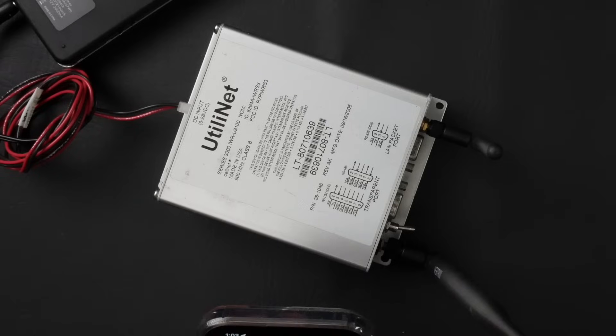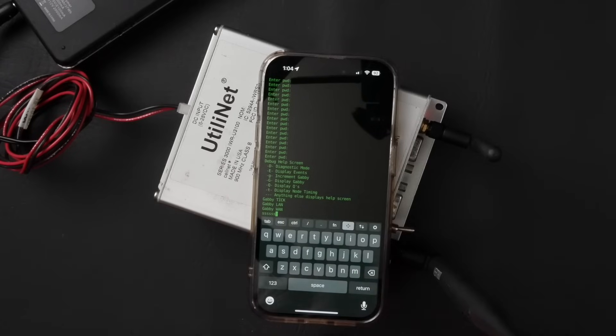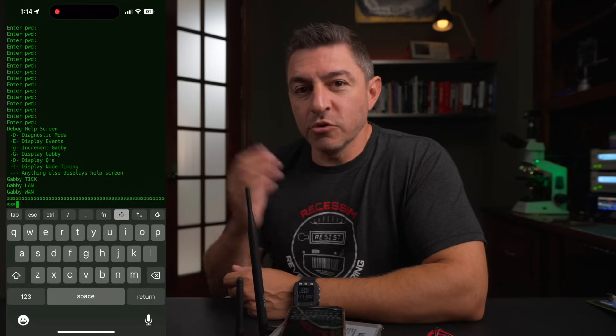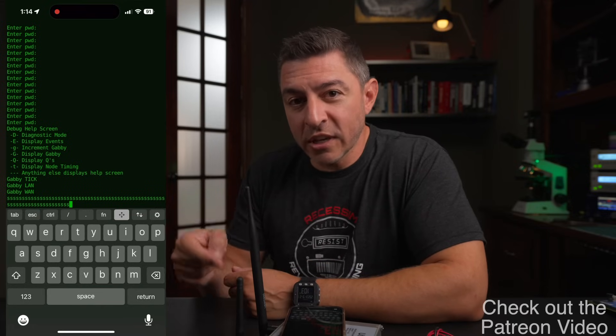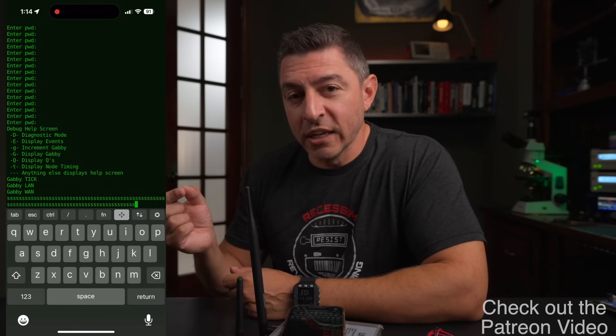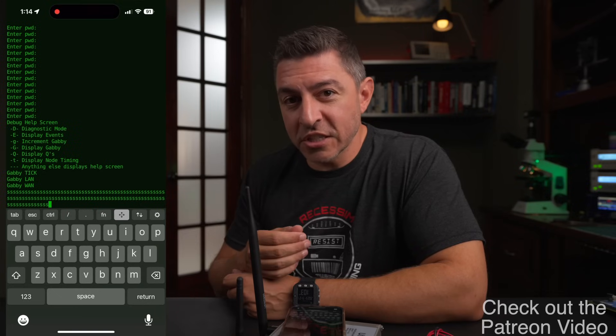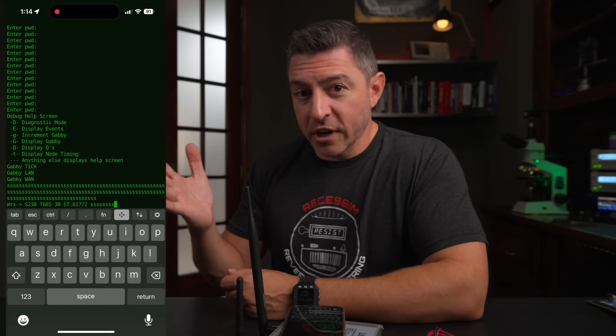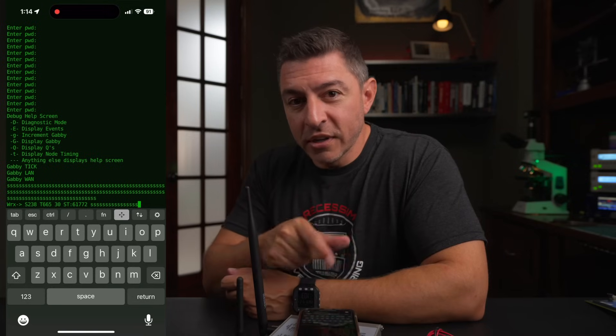It's booted up normally and it's asking me for this super secret password, so I've got to put that in real quick. It looks like I got access. That super secret password just so happens to be in that little memory chip that I can read out now. There's this mode called Gabby WAN. What it's doing right now — these S's mean it's trying to transmit out to the network. When I put a software defined radio connected to this antenna connector and listen directly wired in, I can see it trying to transmit every time one of those S's is sent. It's not transmitting now because I have this switch flipped off, so it can't actually talk to anything — but it's trying to find a network. When it does see some data from a network, it spits it out here on the screen.